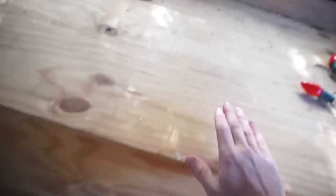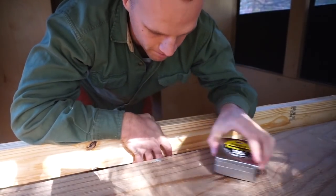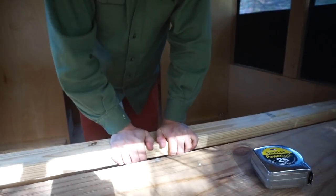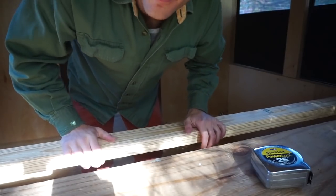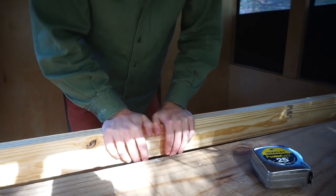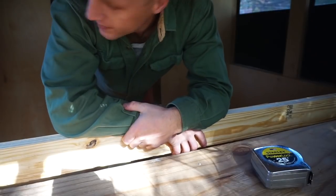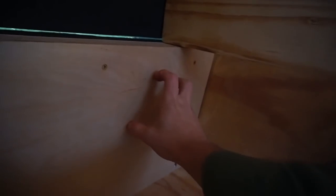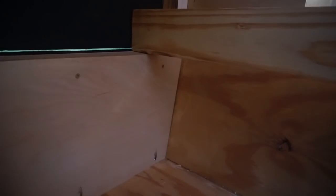I want this to be the same height as this, so that I can then put a nicer piece of plywood across all of it. So this is an inch and a half thick here. Watch how bouncy it is — probably might still be fine with the plywood I'm going to top it with, but look at this. That hardly has any give at all. I could put these guys like 12 inches on center and I would have really a lot of support out of them. I'm going to run a 2x4 along here, then take this, rest it on the 2x4, screw it into the 2x4, top it with the plywood, and that should be all I really need to do.